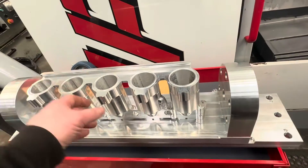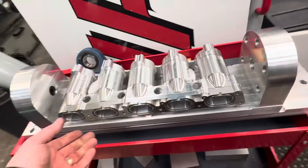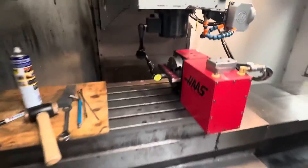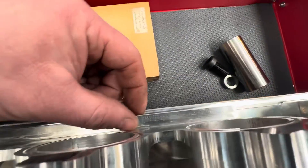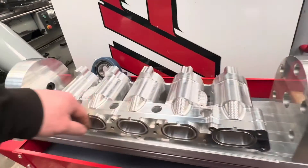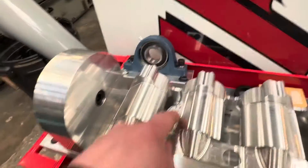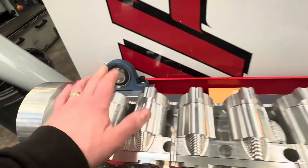Once that's done, I'm going to put this back down in the vices as if I'm doing the next part — because that's the way I'm going to do the next lot. I'll sit it in the vice and clamp it up like that. I'll use probably one of these parallels because they're the longest decent ones I've got — I've got a pair of them. I'll sit them across this face so it spaces out from this section here, and another one across. Clamp the vice, and obviously we've got a nice face to clamp across on there. Then I'm going to do our 3D adaptive and finish this side. And obviously we're going to start to see what material, if any more, is missing off of here. And then that will get this one finished.